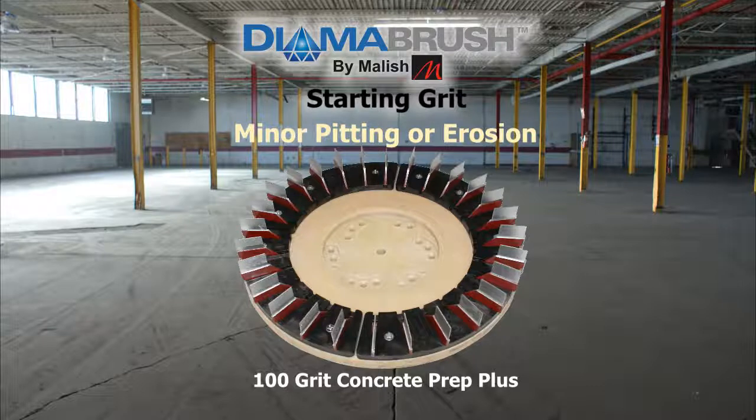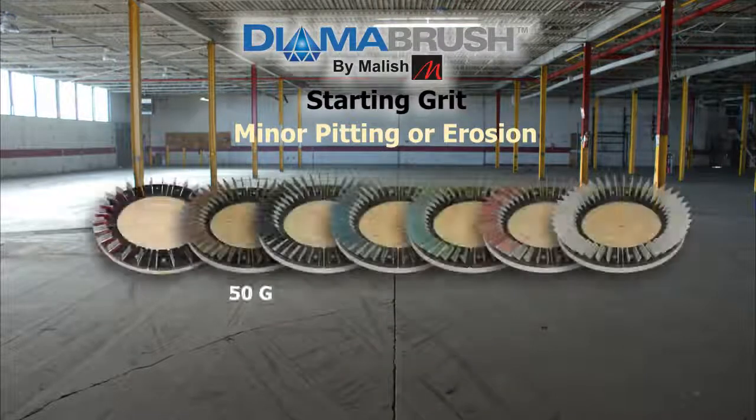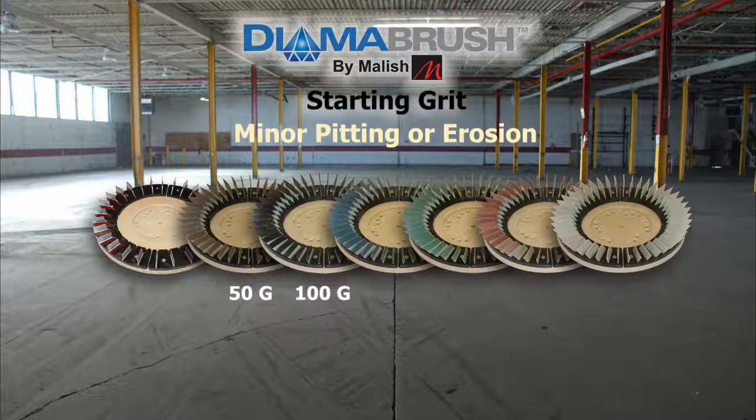3. If you have an old concrete floor that has some minor pitting or erosion, you would begin with either the 100 grit metal concrete prep or 100 grit metal concrete prep plus tools to smooth out the floor. You would then use, in order, the following tools: the 50 grit polymer, the 100 grit polymer, the 200 grit polymer, the 400 grit polymer, the 1000 grit polymer, and finally the 2000 grit polymer tools.